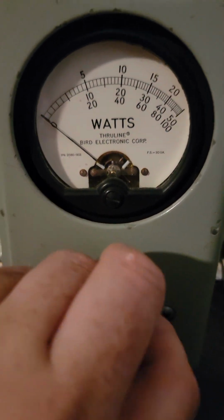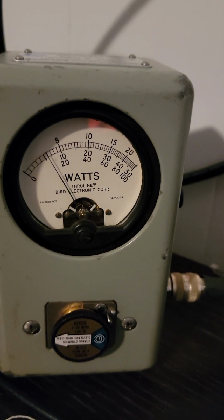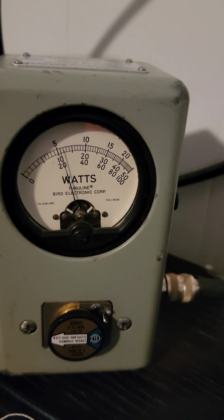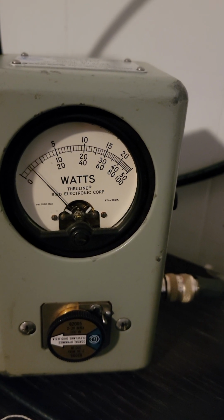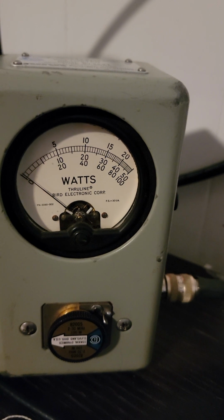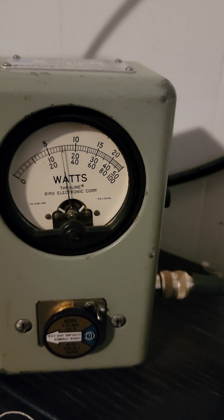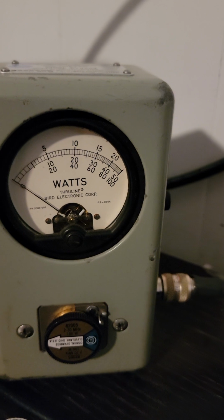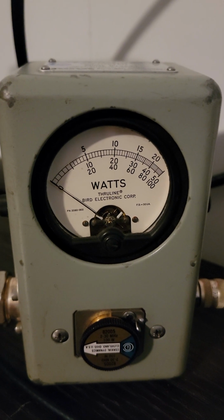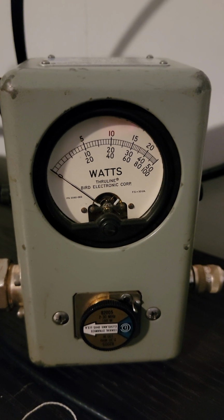Make sure this is in good. Don't drop my phone this time. Peak is on. I'm gonna turn the dead key all the way down. Too much modulation. Might have to turn my mic gain down. About half a watt. Audio 36 or so. Maybe 1 watt. Probably about 1 watt. I think it's actually 3/4 if I put a smaller slug in, but right around that area is the lowest you'd probably want to drive most amps.